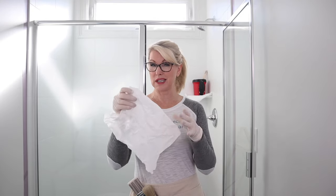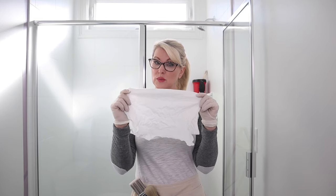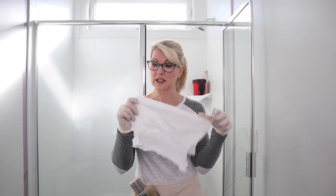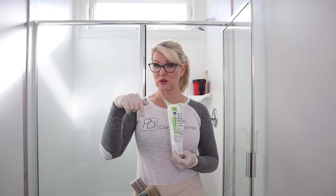A lot of this is going to be working very quickly. I've got a little apron on with my different brushes. The other thing you're going to need are lint-free rags — I got these in a bag from Lowe's, very t-shirt quality material — to offload your turkey feather onto and also your brushes to wipe them clean so you don't keep redepositing paint. Also protect any areas you don't want to get paint on in your shower — I'm protecting my shower floor completely and also the walls with a plastic drop cloth. Then tape everything down so it's nice and secure.